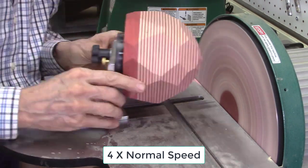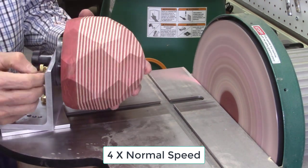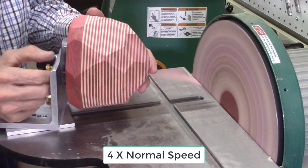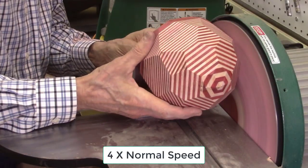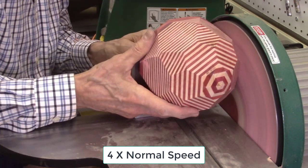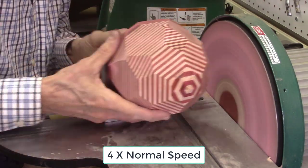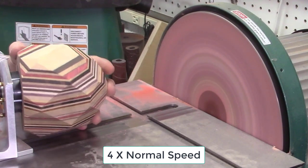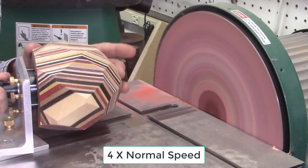Therefore, I try to sand on the inner portion of the sanding disc. Also, when I sand the facets, I use light pressure and short contact times with the sanding disc. For each facet layer, I change the angle position on the L bracket support plate and carefully sand each of the facets. I next sand the second laminated facet block in the same manner using the disc sander.